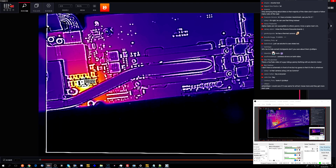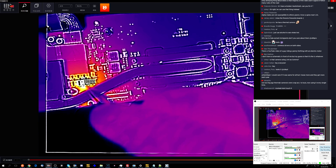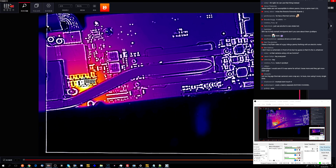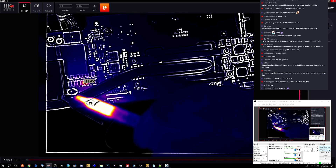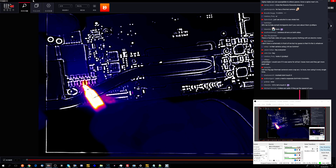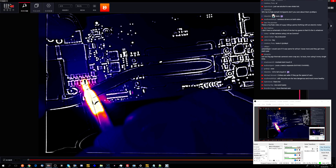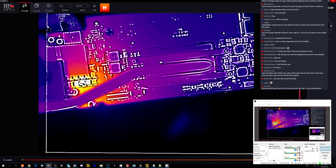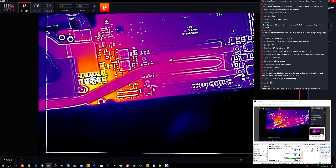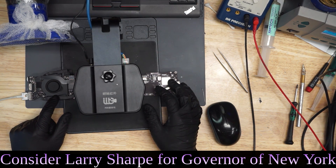Let's see which cap are you — this one? No. This one? No. It's this one. I wonder if we can remove that with the soldering iron without actually having to use hot air. I bet it's going to desolder itself straight off the board. Yep. And look, the fan is spinning now — check that out. Fan spin.